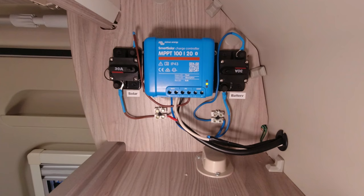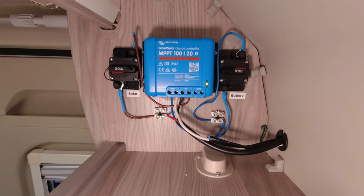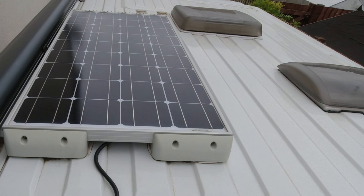I'm now going to have a look at my battery app, and as you can see we're getting a nice charge now. So the fault all the way along was obviously the MPPT, which thankfully has been replaced. Getting it replaced involved a lot of emails and talking to people on the phone and lots of testing, so I hope this video just makes it a little bit easier for people if they think they might have a problem with their MPPT.